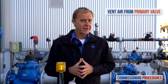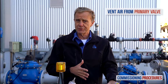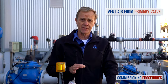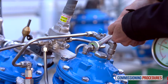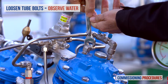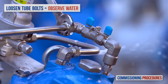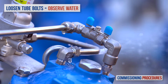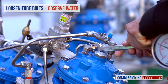Whether or not you've performed recalibration, the next step is to remove any residual air from the pressure-reducing valve's control loop and chamber. This ensures a more stable and positive pressure control. To vent air from the valve's control loop, loosen the tube eye bolt attached to the valve cover at the highest point of the valve's control chamber. As soon as you get the flow of water without air, re-tighten the tube fitting eye bolt.